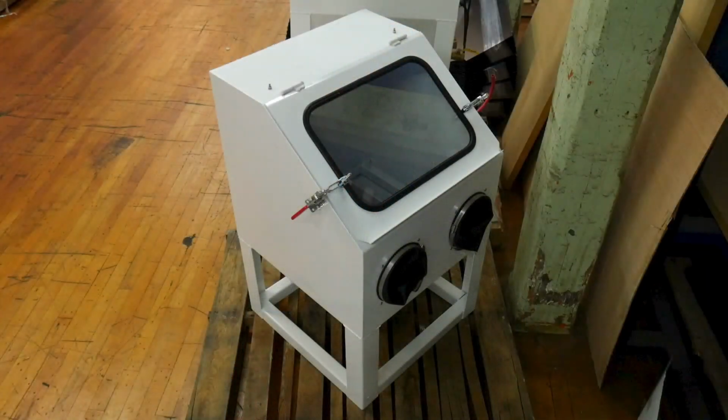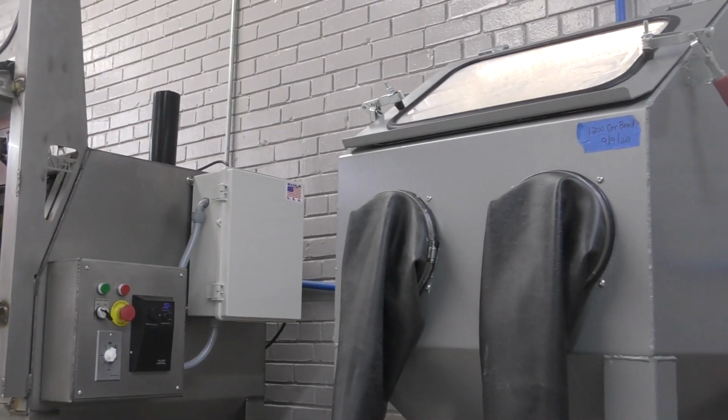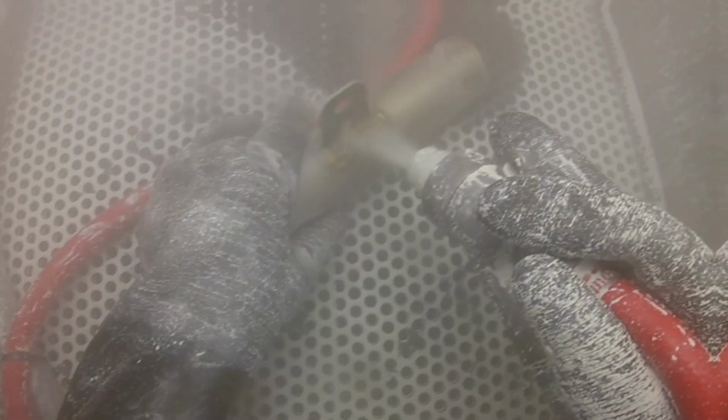Electricity requirements include a 20 amp breaker to run the machine, and you can get it in a 110 volt or 220 volt power supply. Air requirements include 15 to 20 CFM as well. Along with the machine, you also get full product support, an industry-leading lifetime warranty, and a no depreciation upgrade guarantee.